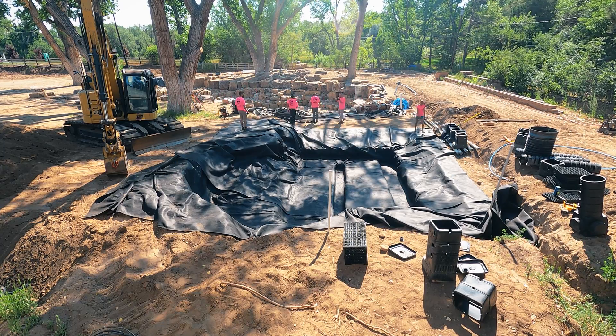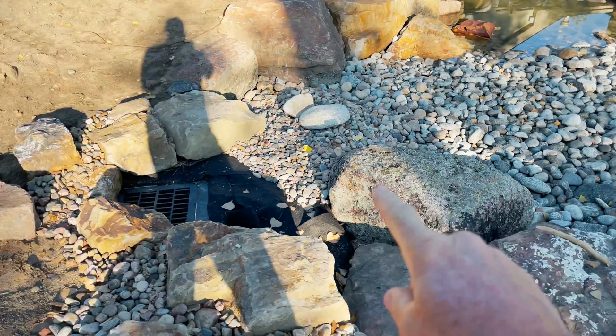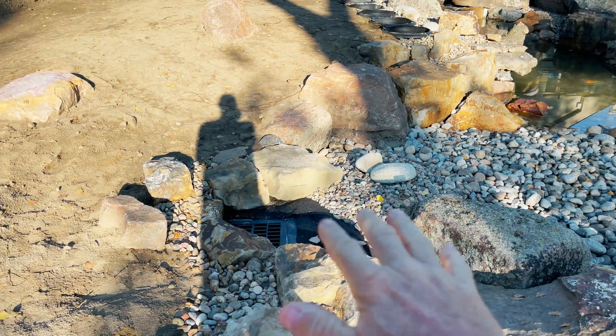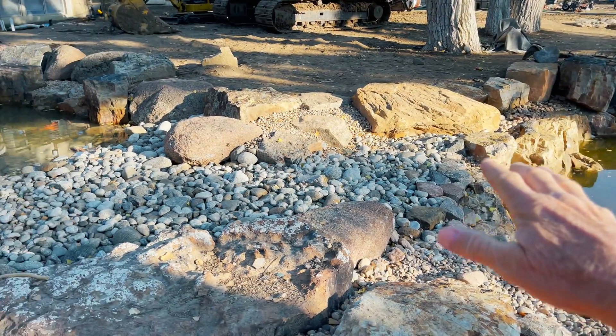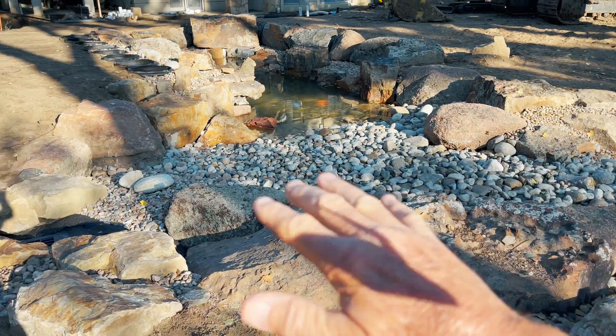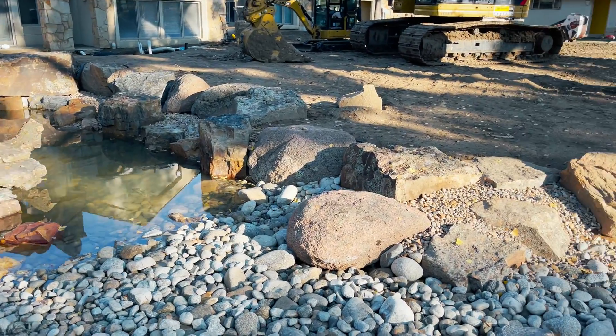We made a few artistic changes in this thing. We got to use a 50-by liner instead of a 35-by liner. That let us have some more shape. We got to pull out into here to do our drainage system. We got to put a lot of curve into it, so the water runs in and comes way around here — it's going to sweep in and go that way. We'll end up with 100,000 gallons an hour coming through this area.